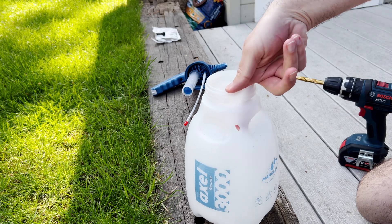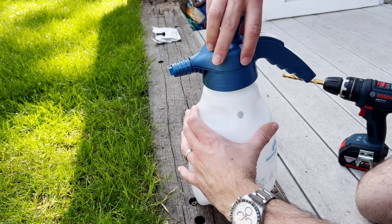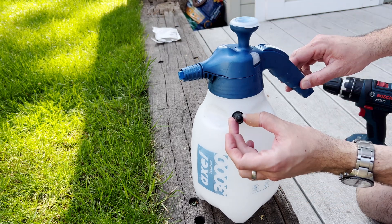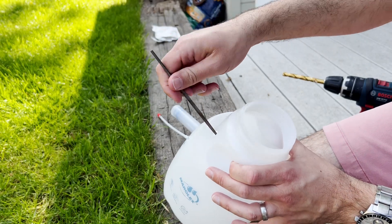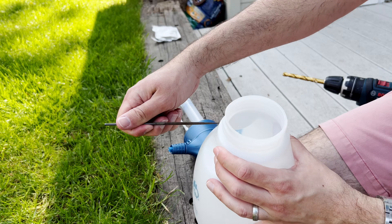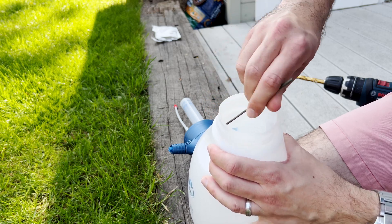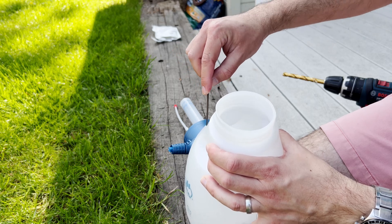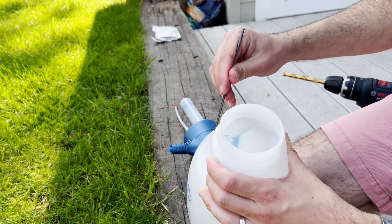Once you've done that you'll find you've got some swarf inside and some sharp edges. Don't worry about the swarf yet — you're going to rinse it all out before you put any product back in. Make sure you position the valve in the correct place: when it's all done up, see where the spout is and choose a location in one of those shoulders which is not under the valve. File down the sharp edges, and I also had to use a Stanley knife blade to trim off some excess I couldn't reach with the file, then filed it back smooth. You don't want sharp edges cutting into the valve or compromising the seal — if it's sharp it could cut into the valve and not hold air, which would completely defeat the object.